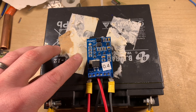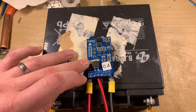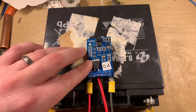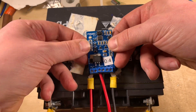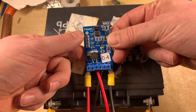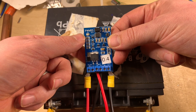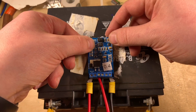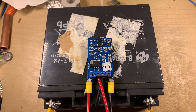The question is how warm is that diode getting. I'd say warm but I can hold my finger on it for a little while. Crucially I want to check the back of the PCB as well — that is quite warm, but it's definitely working. The heat is definitely transferring through to the back of the PCB, so let's leave this for a while and see how well it fares.